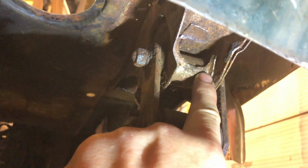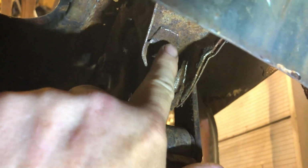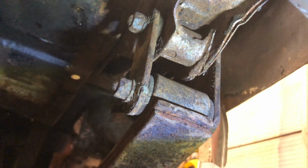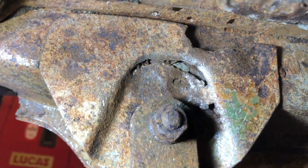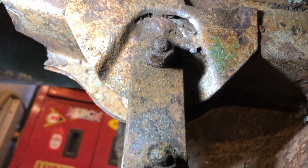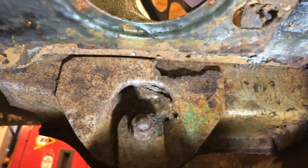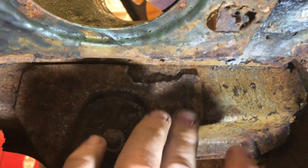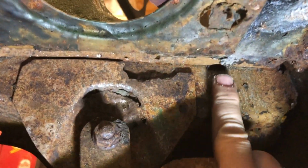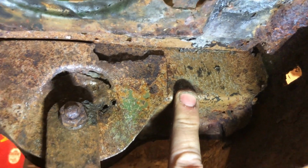So I could seam something across here, clean all this up, take that tab bit off, and then put it across here and then down with some good solid 2mm. This side here, yeah, no reason why not. No reason why I can't just rake all that off. My feeling on this would be, because I want to see behind this, to take all of this off, leave something here positioning that centre pin, and just replace this. That wouldn't be too difficult. See, the actual hanger itself is in pretty good nick, and I don't want to start ripping pieces out that I don't need to. There's enough to do on this without me creating work for myself.